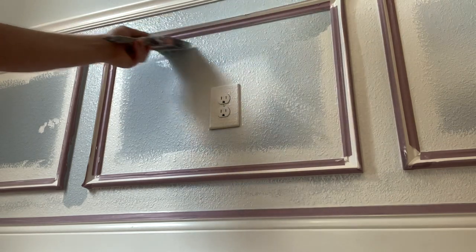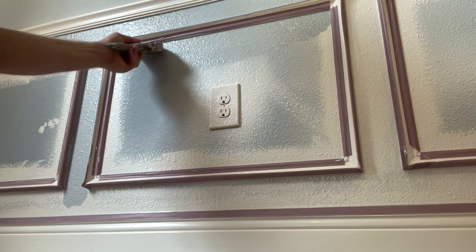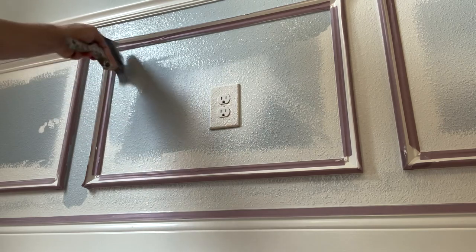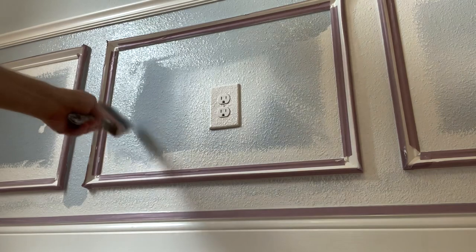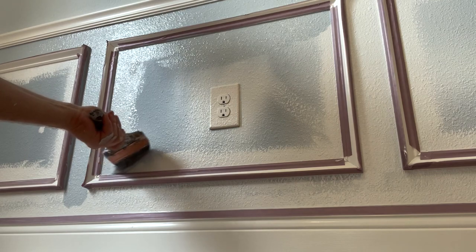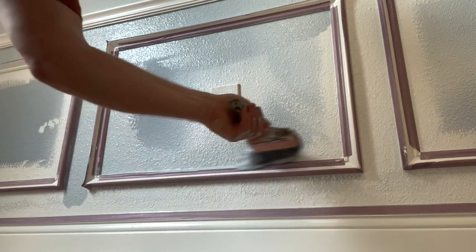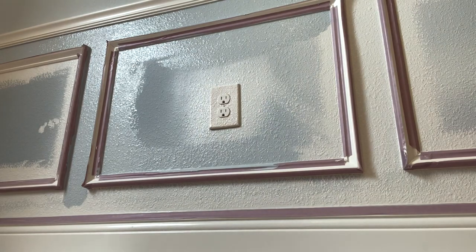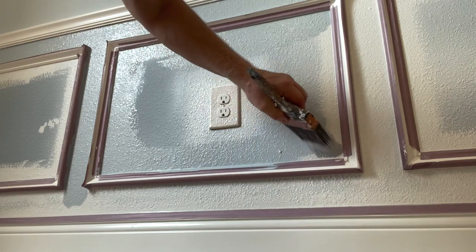And so the hardest task is applying that tape right there where you see my brush hitting it. Because you're working with a very small lip on that trim. Obviously, the outside, you see to the right of your screen there, about 3/4 along the way, you see those vertical strips? That's easier. You have more meat, so to speak, against which to put your tape. But where you see me brushing right there, it's a small lip. At most, it's 3/16 of an inch.